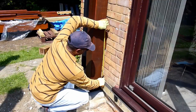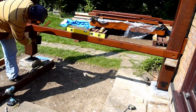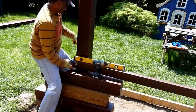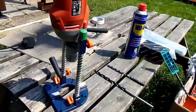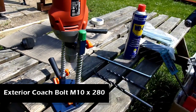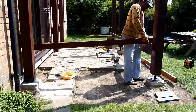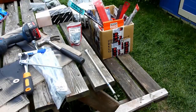The next step is to mark the seat support height — that's 50 centimeters off from the floor. I'm holding it temporarily with clamps and some 2x4 timbers and using a long stretch of 2x4 to make sure both seat supports are at the same height. To fix the seat supports onto the posts I need a coach bolt around 280mm in length — the 2x4s are 40mm each plus 150mm for the 6x6 posts. I'll use a cordless drill with a straight jig to drive in the full length of the hole.